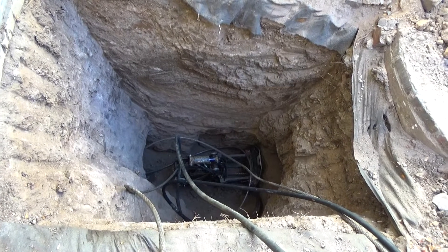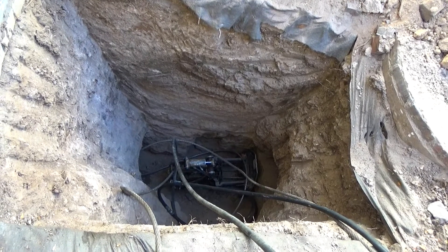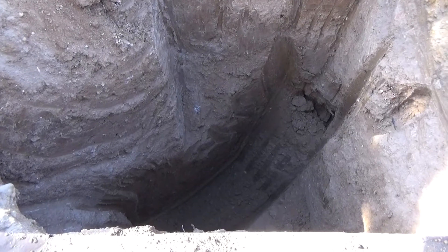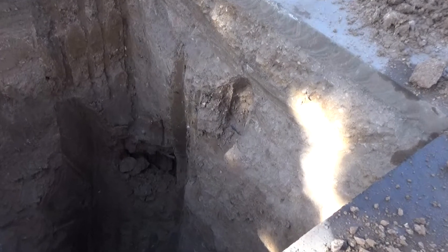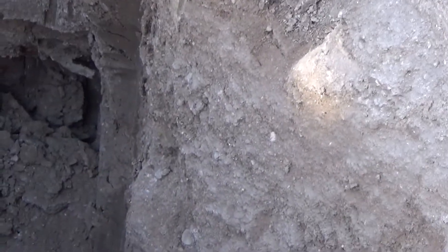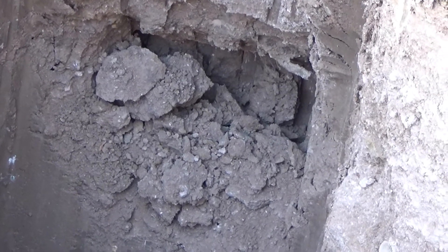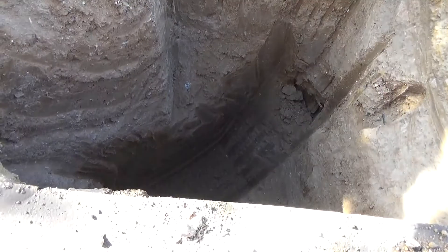There's the hydraulic cable puller that's going to pull the pipe through the ditch — it's all rigged up and ready to go. There's the excavation as it sits now, and right over there is where the pipe that goes into the house should come to. Then it will come across and drop down a total of 23 feet to meet the top of the mainline sewer.